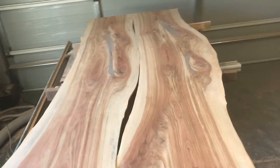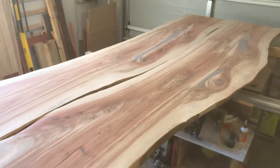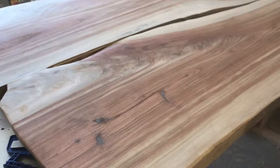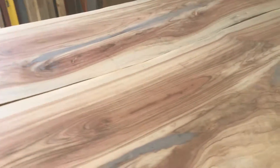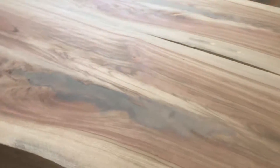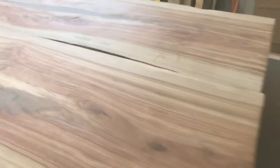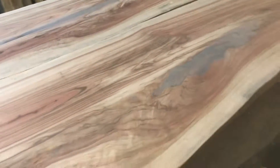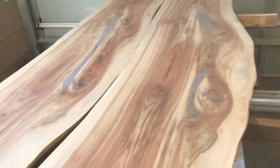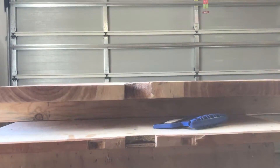I've had a massive day on the sander. Starting from 40 grit I've given it a huge sand down, taking most of the epoxy off. The 40 grit gets down quick but it also leaves a lot of deep scratches, so you don't want to go down to finish level — get pretty close and then stop. Then you work up the grit: 80, then 120, 240. I'm pretty happy with it, got a lot of the lumps and bumps out, looking a lot better.